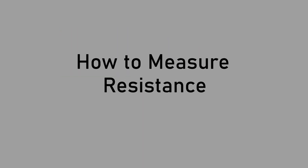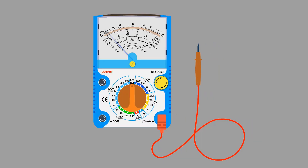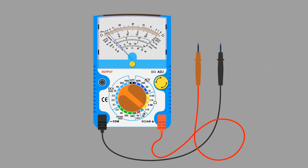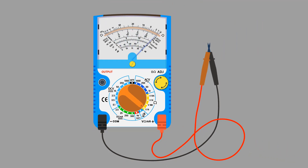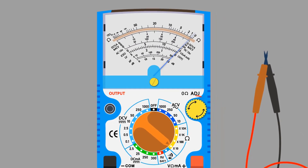How to measure resistance with the help of an analog multimeter. Take a multimeter — connect the red probe with the ohm port and the black probe with the common port. The blinking line shows the ohm section and the arrow shows the measuring range of resistance. Select the X10 range. It's time to calibrate the multimeter: short both probes. If you notice the multimeter needle is not at zero ohm, rotate the ohm knob clockwise or anti-clockwise in order to adjust the needle to the zero scale.